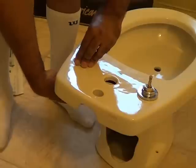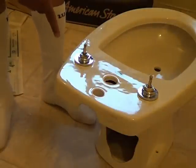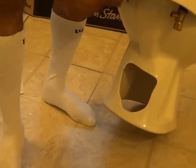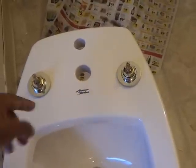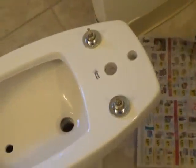I'm going to use the top piece. Right now I'm leaving these hand tight because I'm not exactly sure how I want to have the opening underneath facing. You see right there — those openings, the way it's facing. That there is cold and the bidet swings around where the bidet lines up. This really is hot because you always have hot on the left, cold on the right. So what I'm doing is I'm getting my hot water from underneath the sink. Underneath the sink, hot is there. And I'm going to splice that, get a connector, go through the wall, and then connect. So that's one design challenge.